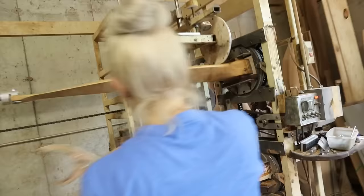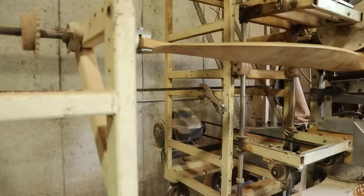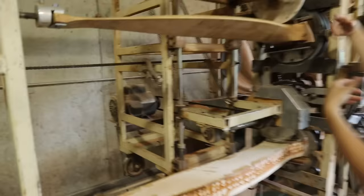That is going to clamp our carriage to this chain that's gonna pull it down as it rotates. So this is gonna rotate it, and then this chain is gonna pull it down. And so essentially, we're just gonna corkscrew all the material that is not a propeller off.